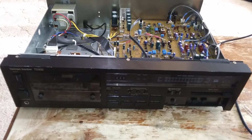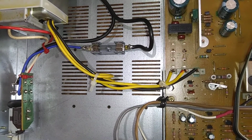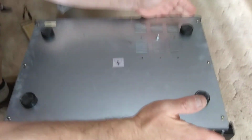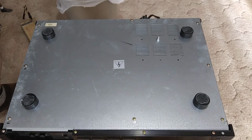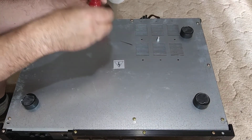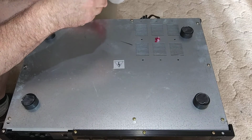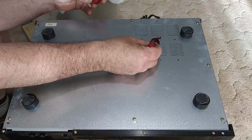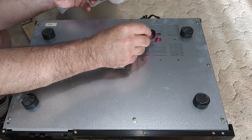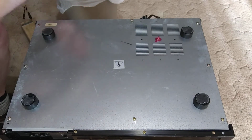This is a Harman Kardon cassette deck, model TD302. And there's the fuse block. Now to finish it off, I'll just tap it upside down like this, just to make sure no loose strands of wire or little tiny solder balls got in there. And I'm going to use some Loctite to prevent this screw from loosening up. Now let that sit and dry.